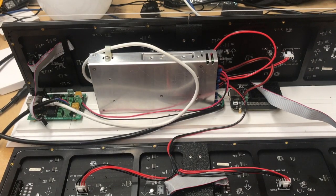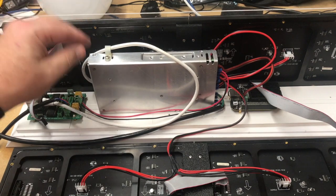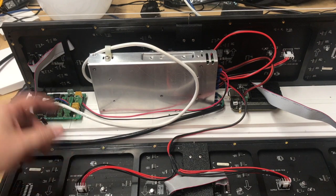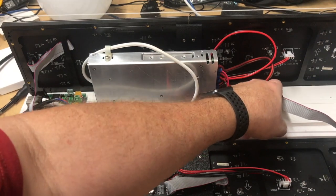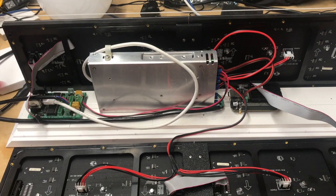I did want to show you one thing that I changed. Previously I had the wires going this way, but having a bunch of weight all the way back here just didn't make a whole lot of sense. I moved the power supply a little closer to the center, and put this old 6804 controller for the pixels that are up in the globe. The BeagleBone is still here and still feeds the panels just like it did before. Now that the cables are coming out this side, I need to figure out which hole to use. I've got some white cable wrap so I'm not going to punch holes in there yet until I get that.